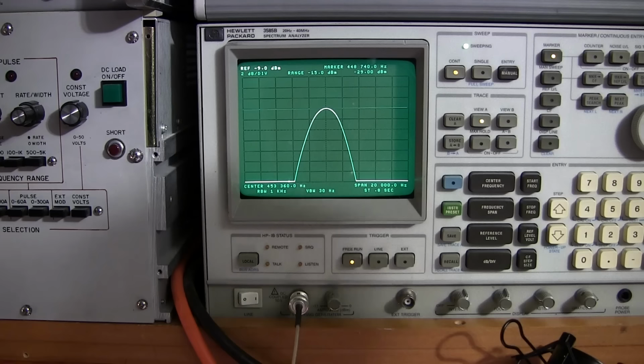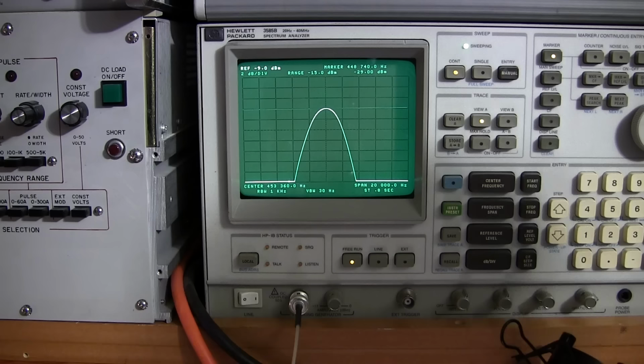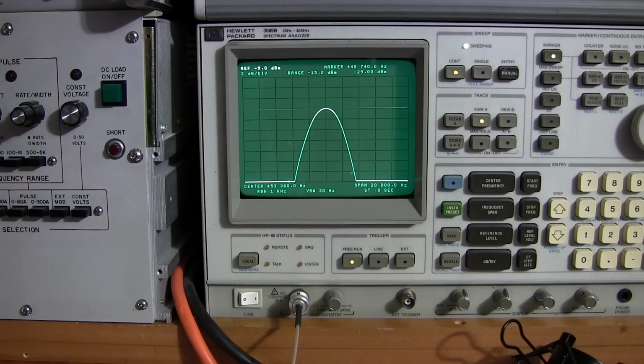So here we go. See how that moved the center right over? That wasn't even a quarter turn. You see how we're moving the center over to this side? So you can see how much that's shifting the IF peak. Those are the two that will mostly affect moving everything around on here. Those are the two that you're really going to have to play with if you're going to try and tune this thing and get this as close to the factory selectivity curves like I've done here.